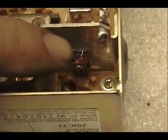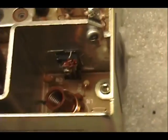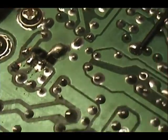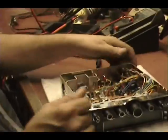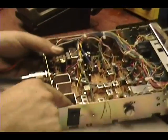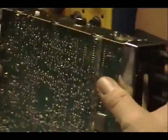So to recap: we're going to change out this driver transistor right here — I have a replacement ready. The resistor R58 was burned, so we're taking out the old hardware and soldering the new components in. I'll put the camera down and be right back. Okay, now we've got it all in there — seated with the insulator and some new thermal compound. Let's try it out.